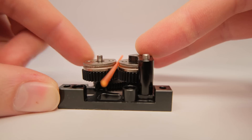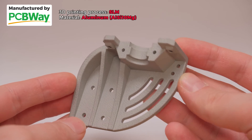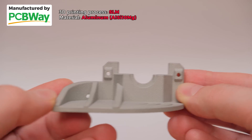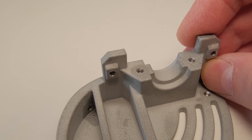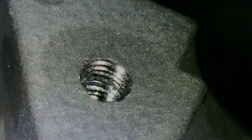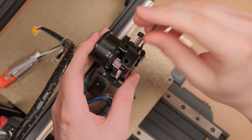To test the HGX Lite extruder, I had to design a custom bracket that the sponsor of this video, PCBWay, 3D printed from aluminum. I used the same design principles as with FDM plastic printing, just with lower tolerances, and it worked beautifully. I also had to tap threads for the screws, which was very similar to making them in regular aluminum. Then I washed the brackets, spray painted them, and assembled the new printhead.